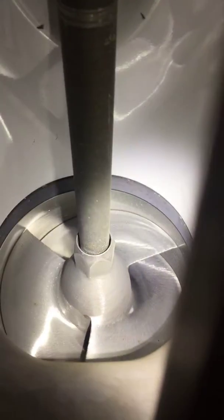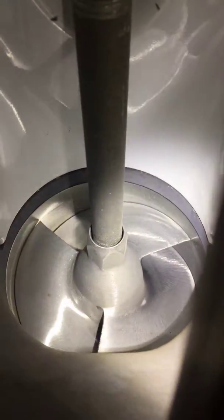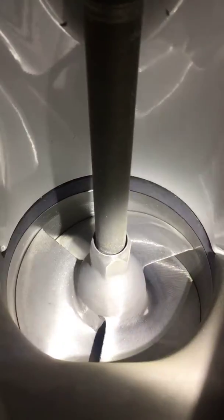When you look at the pump from the inside, there are no cavitation marks or anything. When you crawl up underneath and look from the other side, this pump doesn't look too bad. If you look at the edges of the fins, there should be chips or bends for it to be a bad pump with significant power loss. This one doesn't look too bad — you've probably only lost maybe five to ten percent of your power. But your main issue is that you have a dead cylinder and it's only running on one cylinder.